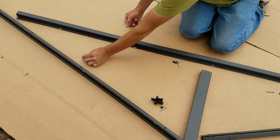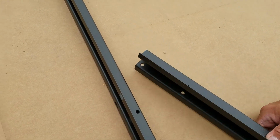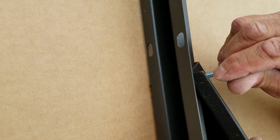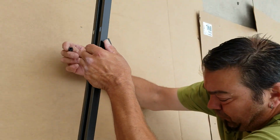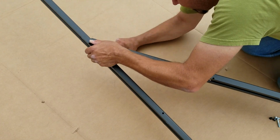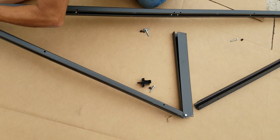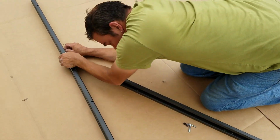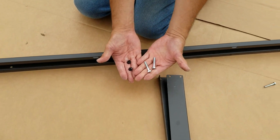And then I always put, it's going to go to the horizontal truss brace, which is right there. I connect one side first, just to kind of hold it there, and just hand tighten the screws, just like you see there, running all the way through the channel. And then just a nut on the other side, hand tighten once again, and that'll hold it. It'll help hold the middle, which I'm going to connect next. And then connecting the middle will help everything hold in the exact place where it's supposed to be, to connect at the top and on the other side of the truss brace.